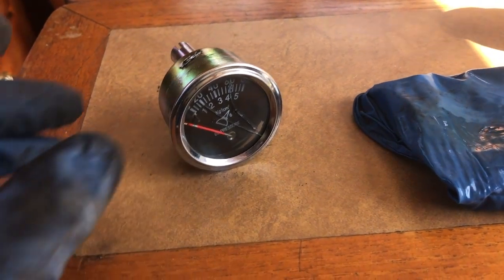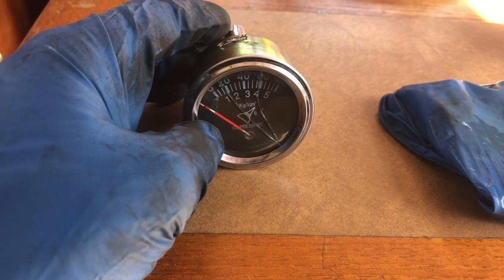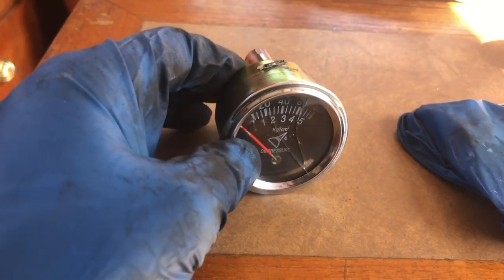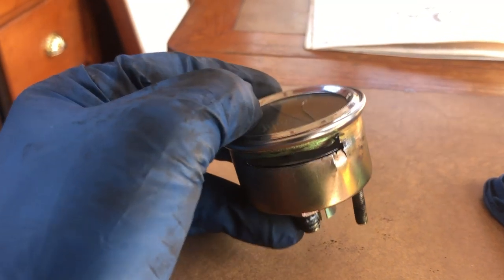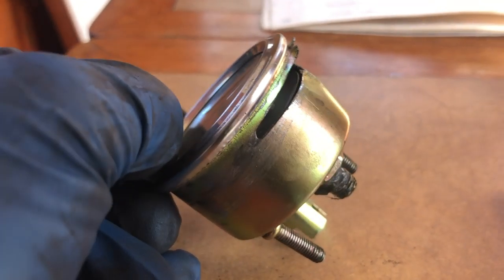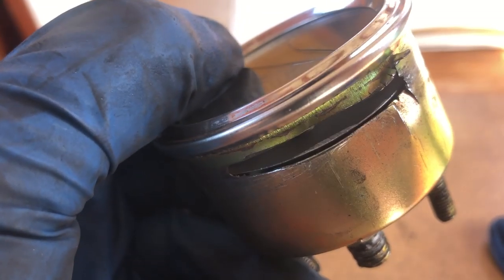Check this out — this is the generator oil pressure gauge. I broke the glass when I was removing it. This thing stopped working — it's been a while, maybe two seasons. I replaced the original, wasn't sure why it stopped working. Put the new one in, worked for a little while, then it stopped. So I've bypassed the emergency low oil pressure cutoff and ignored it, other than monitoring the engine more diligently. In removing this gauge today, I discovered that the housing on the generator from all the vibration has actually cut through the gauge and damaged the needle. See how that slice is from vibration — I chewed it up a bit trying to pry it out with a screwdriver, but the slice is from the vibration of the unit.